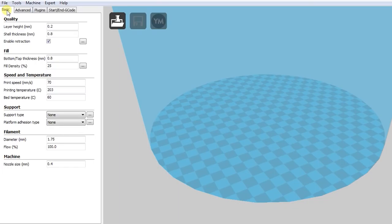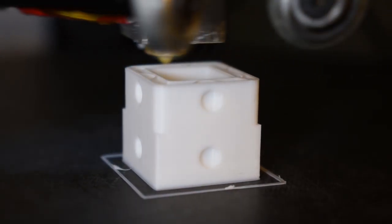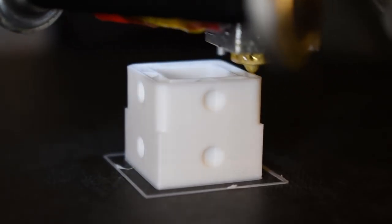I will use the old version of Cura, because for these first prints I think I don't need to complicate things. With the profile created and using all the guessed settings, let's print my favorite calibration model, the Ripple Test Cube, with a print speed of 70 mm per second.